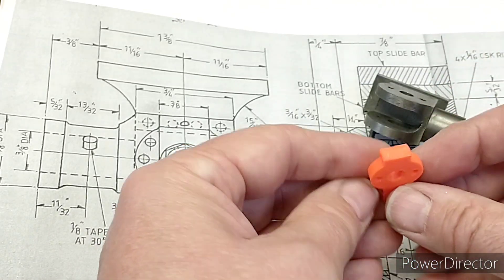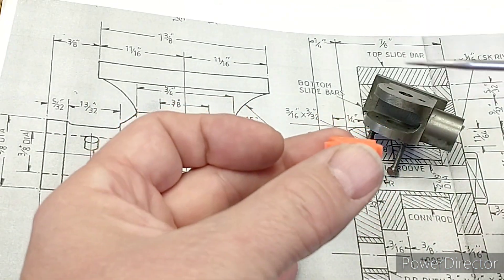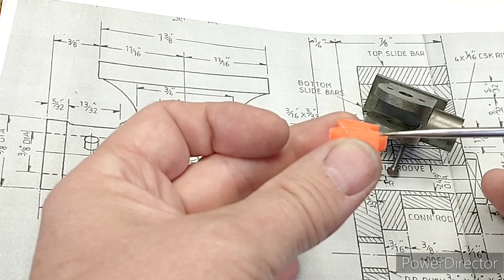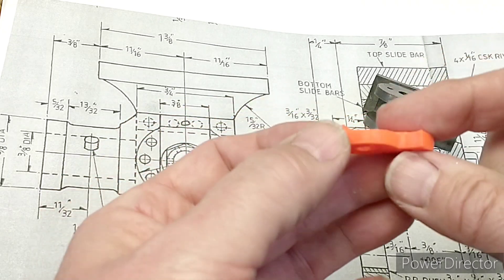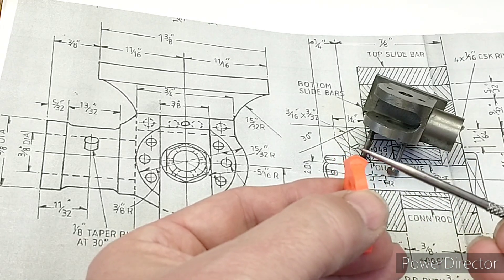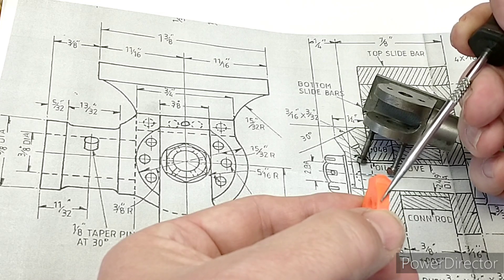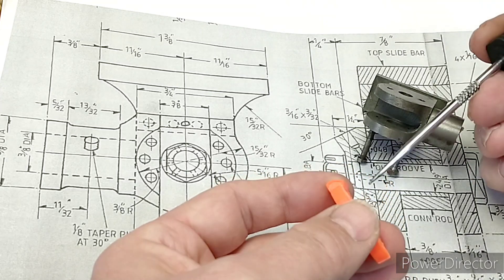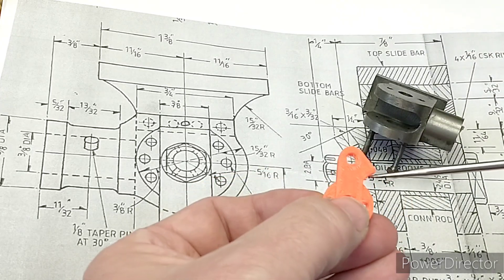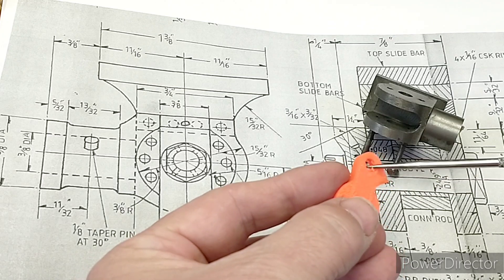It's quite a complex shape and we've got two levels. You've got this top face and then a recessed area, and on this side we've got an angled face. That's basically to allow a hole to be drilled through for lubrication. There's also an angled face here as well.